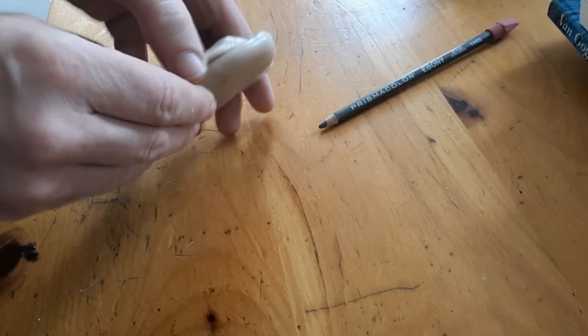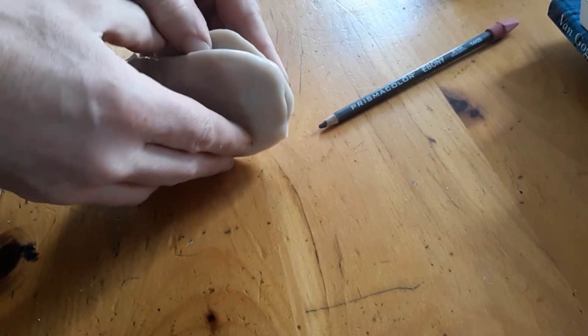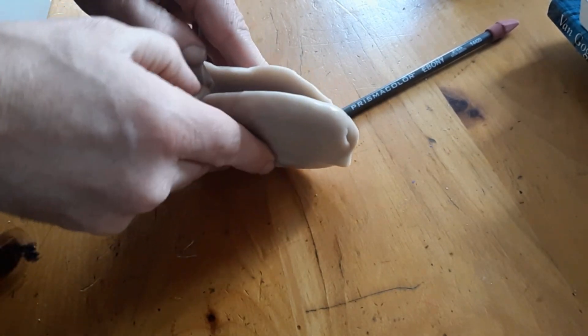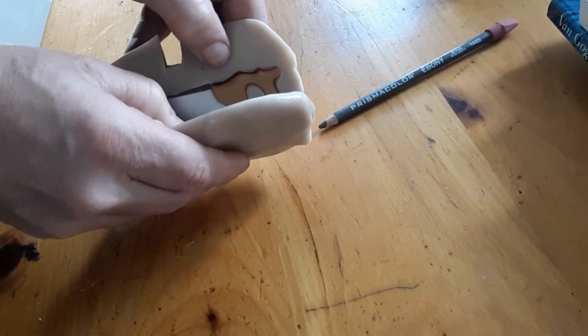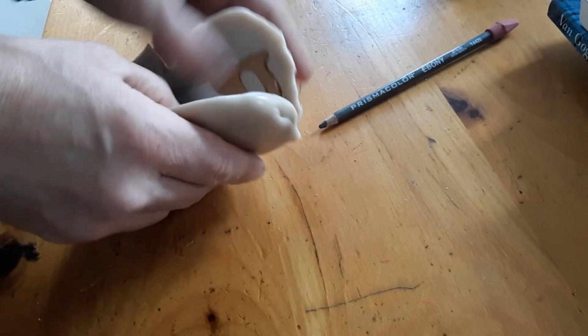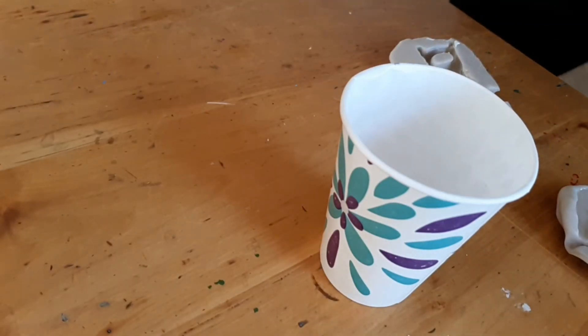That's the process for making a two-part mold. To solidify it, I could have put it back in the freezer. If I was worried about the two halves sticking together, I could have chilled the first part first so that when I pressed the warm impressive putty against it, they wouldn't stick. In this case, I didn't do that and the parts still didn't stick — I would have had to heat both halves and press them together for them to bond.